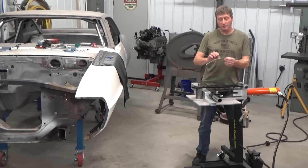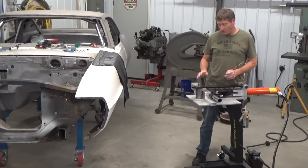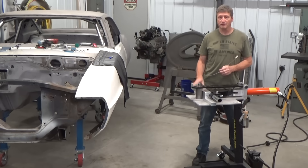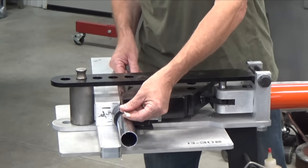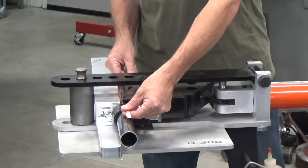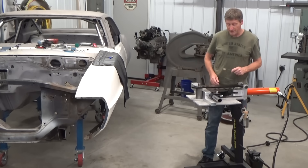So this is what my centerline bend radius and tube length looks like. I'm using a piece of that high-strength steel Docol tubing that I made the cage out of. Basically it's just take my template, line it up with my tube centerline, and make sure that I get the proper bend radius. Then I can trim the ends to fit.